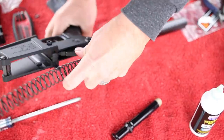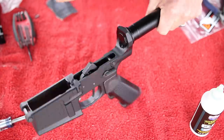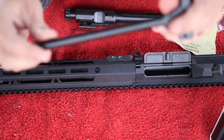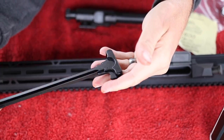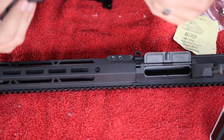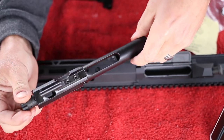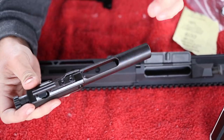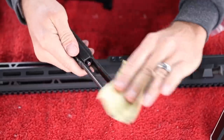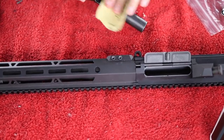We're going to be cleaning this thing often, so getting a little extra lubricant in there is not going to be a bad thing. For the upper parts, we're going to do something similar for the bolt carrier group and the charging handle. This charging handle actually looks like it's got a pretty decent finish — it feels nice and smooth. This bolt carrier group, however — and this is really common for cheap inexpensive upper receivers — we're going to take our sandpaper and knock down any burrs, smooth up the finish, and polish it really good with our polishing wheel. You can use just a rag and your favorite metal polish as well.